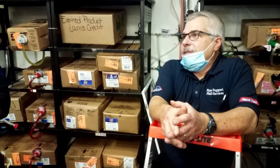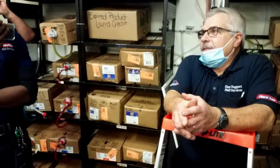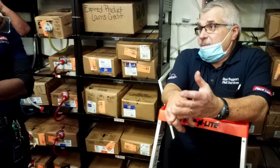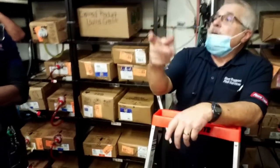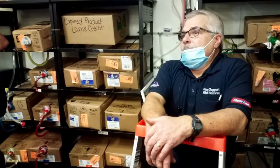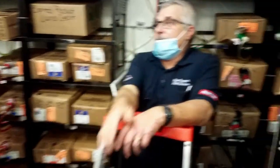Sometimes they really see it. It'll pop up on all four barrels, no matter what you're doing. All four of them will say H2O and go in and out of that. Then you either have a problem with that water booster pump or with the water pressure sensor. One of those two. Or the water filters are blocked. Yeah, I've seen that. So when you see that pressure drop, it's starving it, boom, there goes that sensor saying you don't have enough water. So it could be the filters.